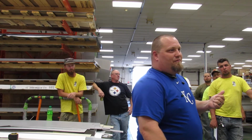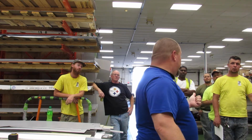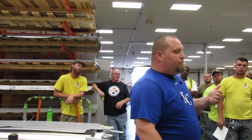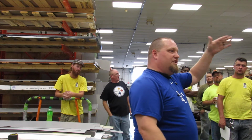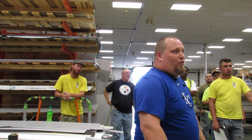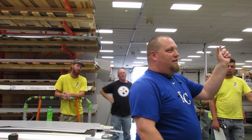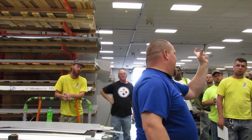Brick's pretty simple, but lintels, we've got to watch penetrating lintels. As you go through the different substrates, it should be designed where the waterproofing and through-wall flashing of the lintel is higher or steps out away from where we have to fasten, but it happens all the time. Ian's got a job right now where we're doing a window replacement, and there's not supposed to be a lintel there. Well, there is now, and there's no visible through-wall flashing. The only place we have to fasten is in that lintel.